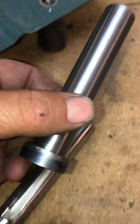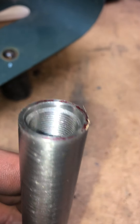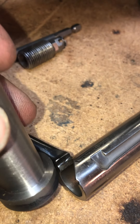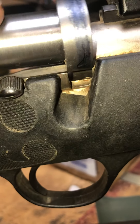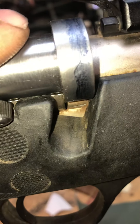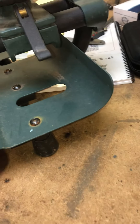So I ordered a piece of stainless and got it machined for a threaded nose piece that will guide the firing pin. I left a shoulder on it that matches the thickness and diameter of that section of the bolt that goes into this pocket. It just locks into that slot in the receiver, and that'll keep the bolt from coming out of the gun.